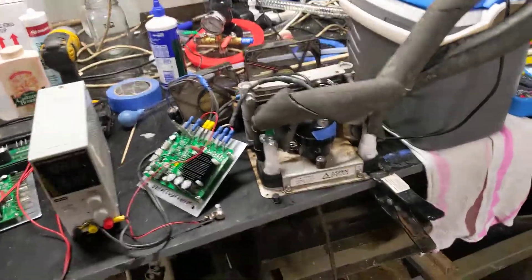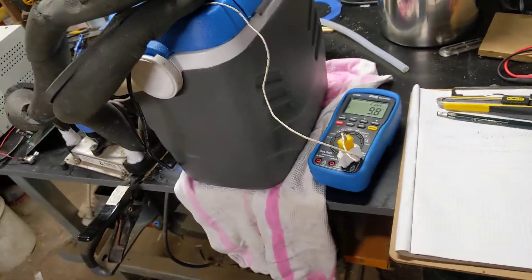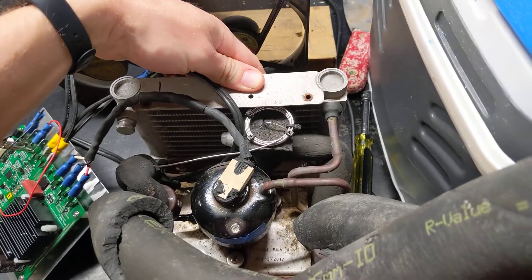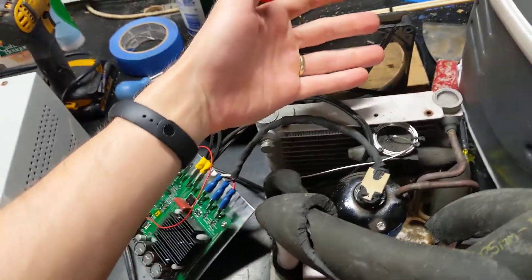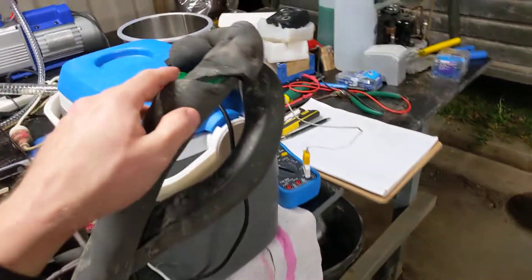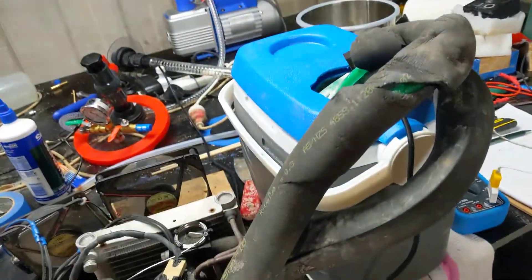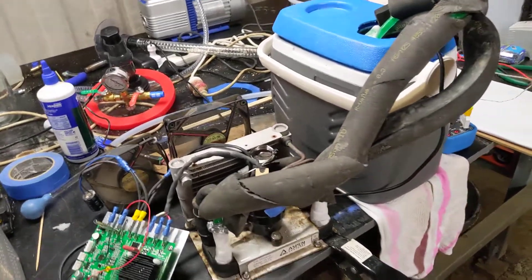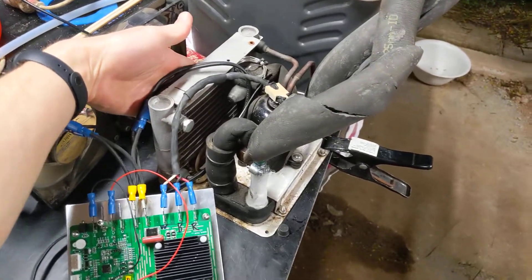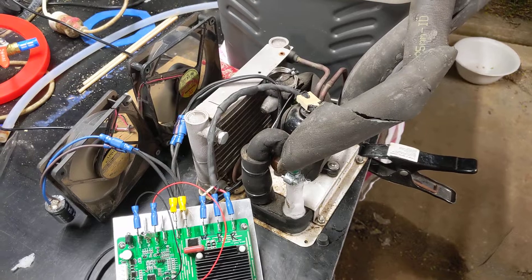It's 21:30 hours, we've been running for about five hours now, and it's down to negative 10 degrees and it's not going any further. I know this because the radiator is now at room temperature — the radiator needs to be hotter than the room to be able to add heat to the room from the coolant, so it's not going to get any further. The insulation worked — it's got a little sheath of ice trapped around it now as opposed to just dripping water on the floor. I think the only option from here is to have one of these pumping coolant through a radiator sandwiched against this one, to blow cold air onto the radiator and reduce the temperature differential this one has to handle. But I don't know if I can be bothered. I'll think about it.